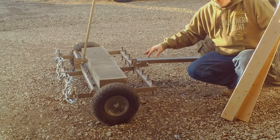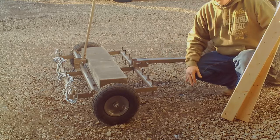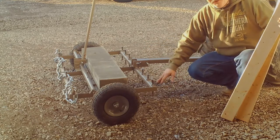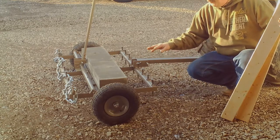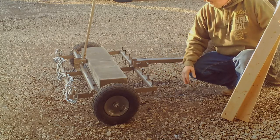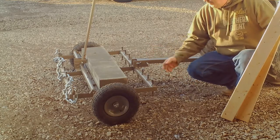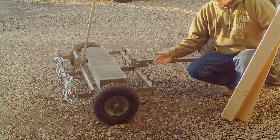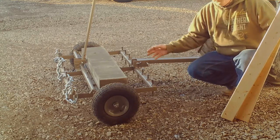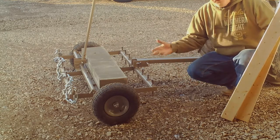This is very loose. It's frozen out here now, winter here, and I've done it a lot, but it's mostly been dug at 2.5 inches. I really don't need 2 blocks to dig it. The theory here is you don't want to push the frame into the ground. You want it to float as much as possible. So if you're in really loose soil, you may not even need the 2 blocks. You have to adjust it to however your soil conditions are. In gravel, I could probably do this with 1 block now. But on these old lanes, you might have to go over a couple of times to get it broken in, and the pins will keep driving in, and it always keeps getting better results.